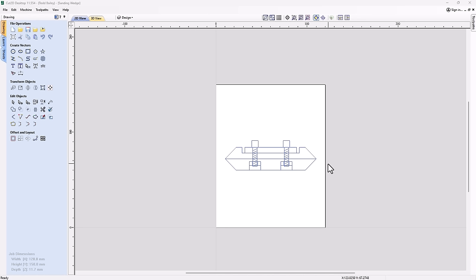So we're going to need a couple of hex bolts, and we're going to need to make ourselves a bit of a plug. The idea is that we can take a rectangular piece of sandpaper, wrap it under this side of the plug, around the outside, up the other side and back underneath again. When you put the bolts through the plug, they'll tighten into these nuts at the bottom and secure it in place so we can use it. That might not make a whole lot of sense right now, but in the end, you'll see what we're getting at.